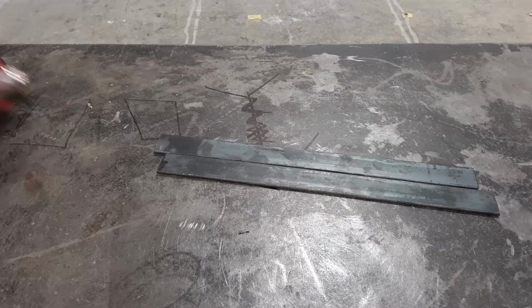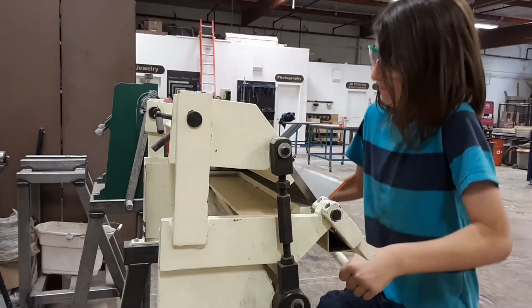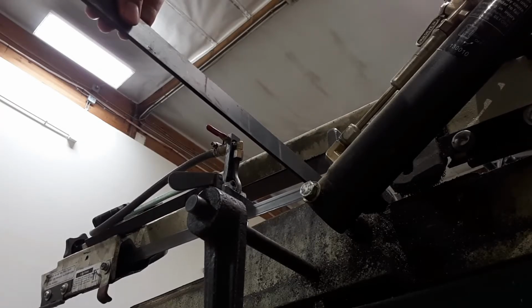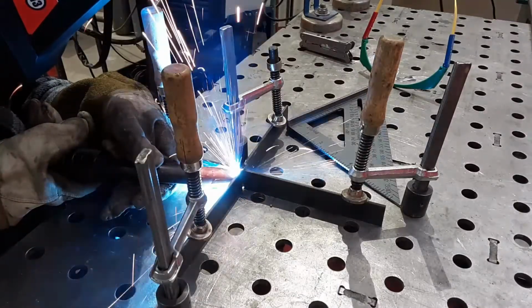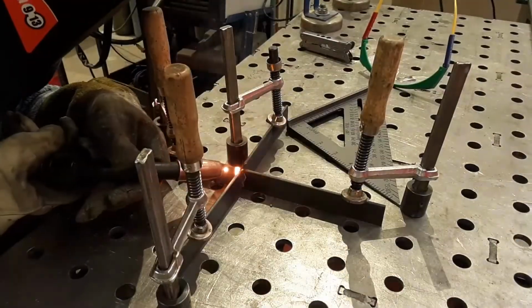The legs are made out of 1/8 by 1-inch flat bar that I bent at a 90-degree angle halfway up the 4-inch piece. For the cooking surface, I cut 2 12-inch pieces of flat bar, which I bent at a 45-degree angle halfway up the pieces. After they were bent, I welded the 2 pieces together at the middle to create an X shape, which will go on top of the flue.